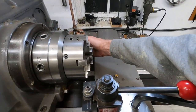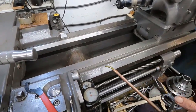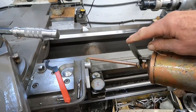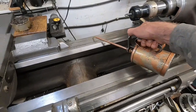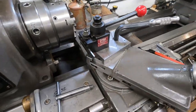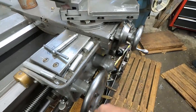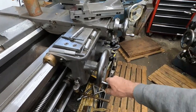I'm oiling it and running it forward, then oiling the back here. This machine has way wipers with brass scrapers, springs, and felt, and those need oil too. I oiled them when I oiled the machine. Run it back and look at this — this is an 80-year-old Axelson. It wasn't doing that a minute ago.